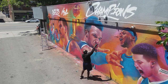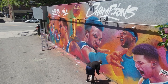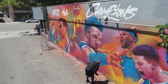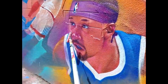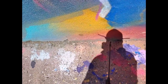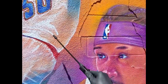One thing I found is that this coating spreads really, really far — it doesn't take long to cover an area. Even though this is a textured wall, it got into all the little cracks and nooks and crannies because of the watery consistency. It covered a lot of area for this size. Anywhere I put it on really heavy where it was dripping or streaking a little bit, I brought a roller just to smooth that out, and then continued with another coat of the anti-graffiti coating.